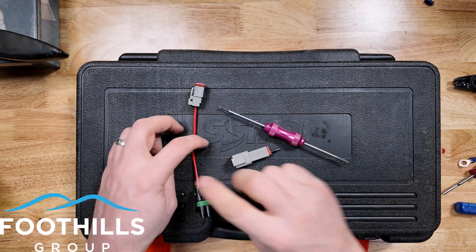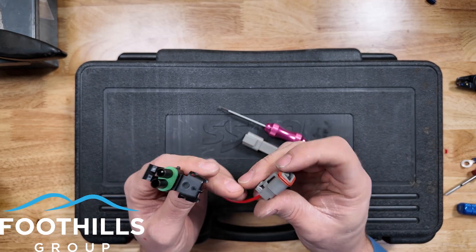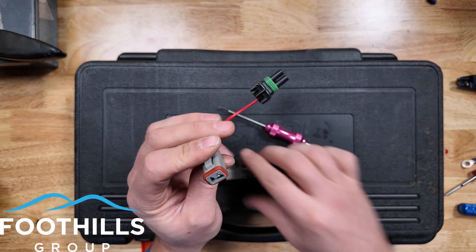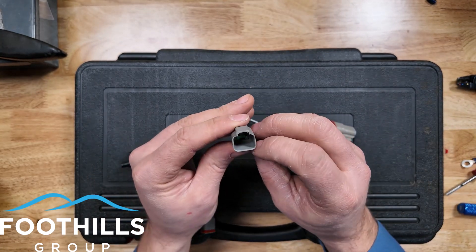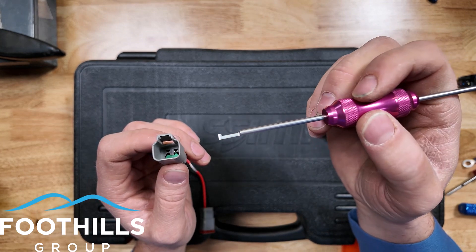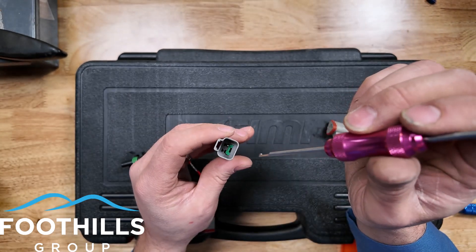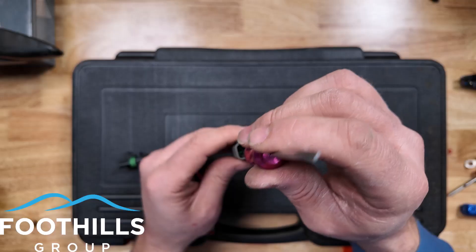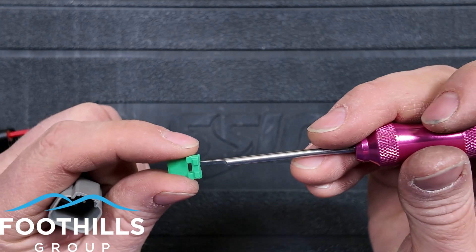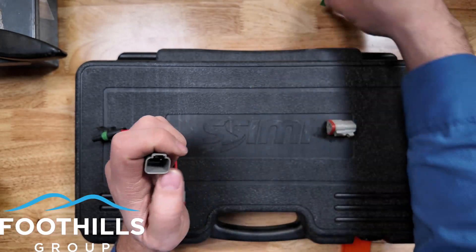Let's talk about assembly and disassembly now that they've been crimped and put into their plugs. These techniques are the same for two, three, four, or however many pin and socket connectors you're using. For small two and three pin connectors, you can usually just pull the locks off the top or out of the center — there's a small green tab in there that holds the fingers down. This kit comes with a notched screwdriver — you can also buy these separately as retaining or secondary lock removers. Stick it in, there's a little box down in there — give it a half twist and you can pop that lock right out. If you don't use this tool, you're sticking a seal pick in there and either stabbing yourself or damaging the connector.